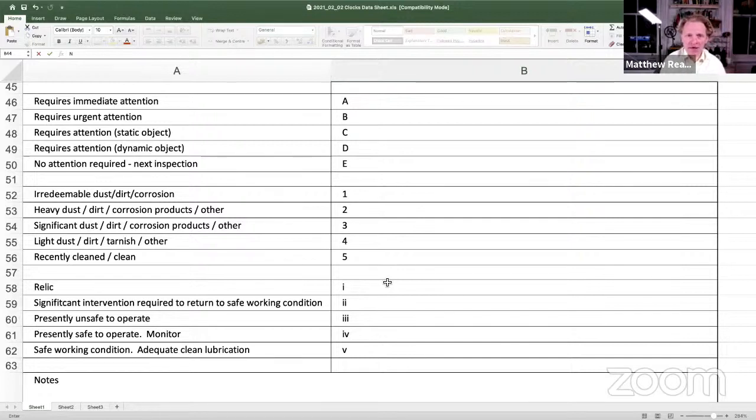So in a typical long case clock, like this one, which is in fact near the top of the stairs in a building, there are a lot of convection currents in that building. So the oil is going to get contaminated with dust, and it's particularly the mineral dust, things like mica, that is problematic to oil because it forms a kind of grinding paste. So there's one thing looking at a big layer of dust on the seatboard of the clock, which frankly, who cares really? There's another thing looking at oil on working parts.